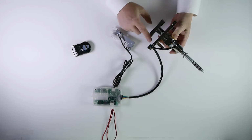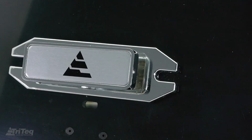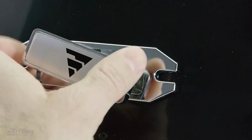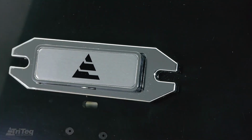Once fully assembled, the unit is locked by pushing in the T-handle to the latched position. Make sure to overturn the handle about 1/8 of a turn in the clockwise direction, and then turn the handle back in the counterclockwise direction so the handle is free moving before pushing in the handle to the latched position.